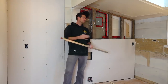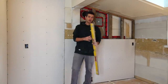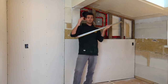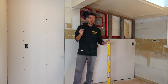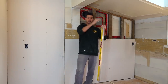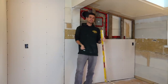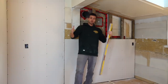So it's really important that you check the framing instead of just willy-nilly hanging the whole ceiling or wall. You actually check: okay, I've got a 12-foot board, where does that land? If one sticks down a ton, you better cut it back one joist. What happens when you go one over from the down joist and put a joint there is that a good finisher can actually build that out and float out that inconsistency. But general practice is to try and go a little bit even further away, like maybe two joists away from it.